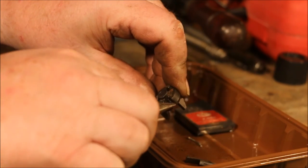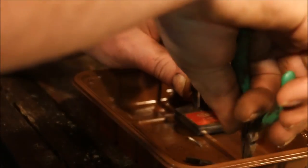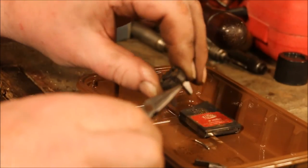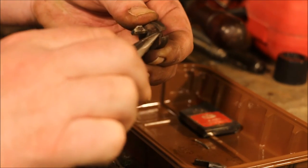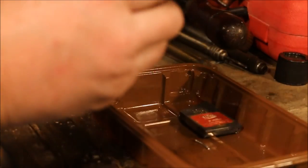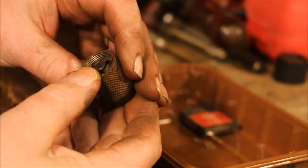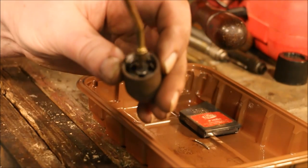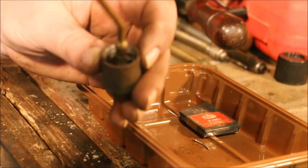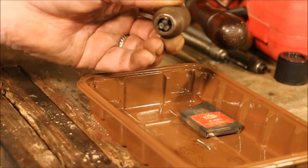I'm going to insert the spring. There's that. Then I put that pin back in place and I slide these into position. Well, that's got everything held together. While I got it apart, I'm going to put some oil in there. Those missing pins were making the chuck not work as well. Now it opens and closes much easier than what it did.